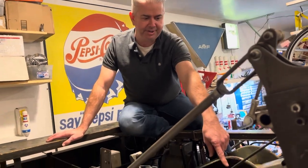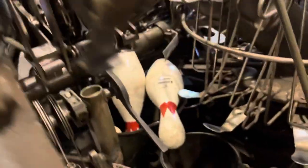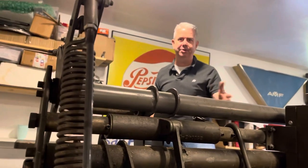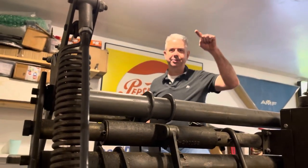We have a deck jam in the 7-pin bucket down here, and it caused the blackout system to engage, which has basically a micro switch with a spring-loaded cable attached to the deck cable system. Anytime anything interferes with the moving of the deck, the spring-loaded cable pulls down.